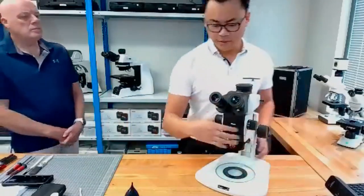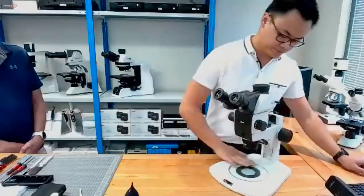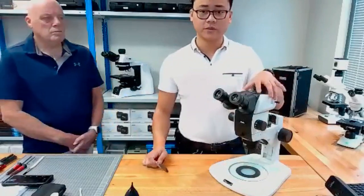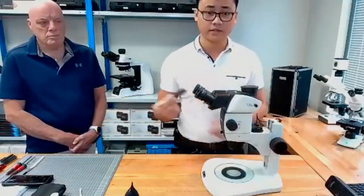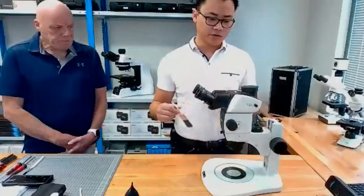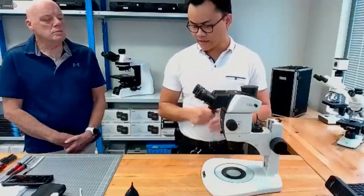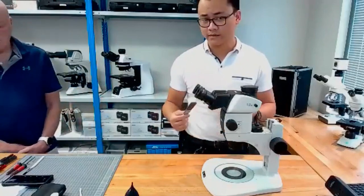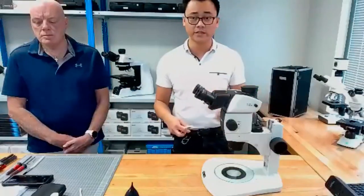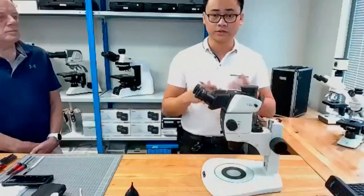With the stereo microscopes, they're pretty simple and easy to maintain. You want to keep your stage clean, touch surfaces clean — they can just be wiped nice and easy. You'll want to dust your equipment off. A soft brush works well — literally a paintbrush is the best. Natural fiber is better than synthetic because if you introduce chemicals to it, it's unlikely to break down. The problem with synthetic is it will interact with basically all cleaning agents, melt over time, and you could end up smearing dissolved plastic onto your equipment.